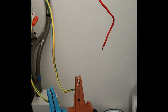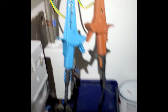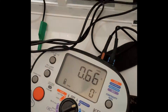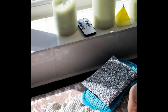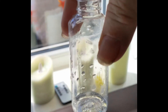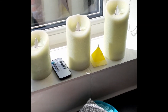Just to prove that this cleaning method actually works — here we are connected onto the CPC and there we are: 0.66. Those CPCs have cleaned up really nicely. I'll show you what we used: white vinegar, ordinary salt, and a little bottle. Left it for half an hour, then used that in water to clean off the contacts, gave them a dry, plugged them back in — and you've just seen that it worked.